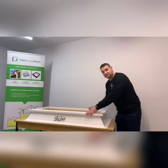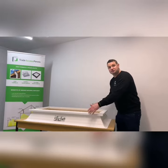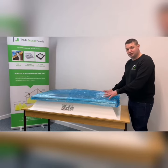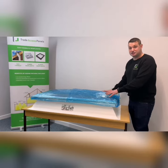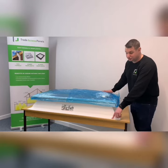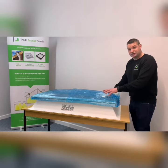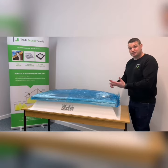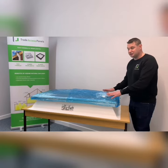Your upstand tapers in, so your daylight size will reduce. So clearly with the roof lights, you get your upstands and your dome, and all the fixings and your installation instructions. You get fixings to fix the upstand to the roof deck, fixings to fix your dome to your upstand, and they're security fixings with a fixing capsule on top as well. Everything you need is in the pack.